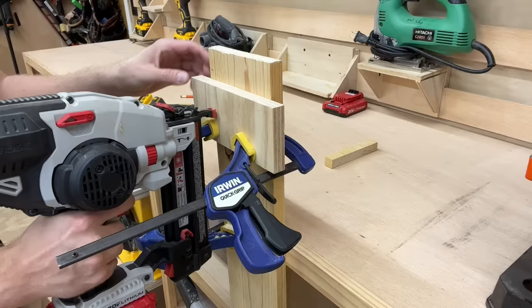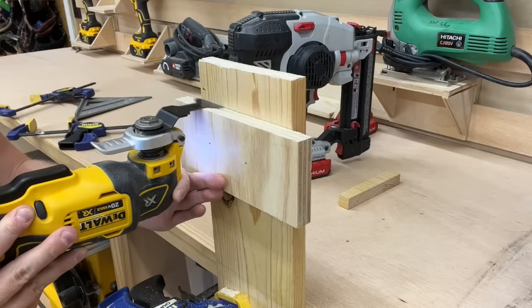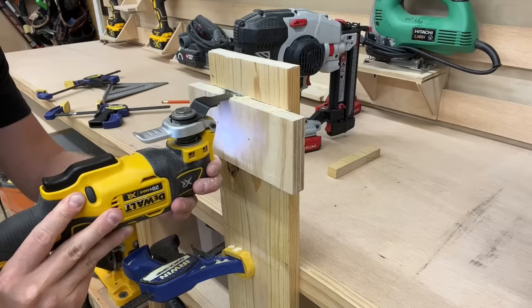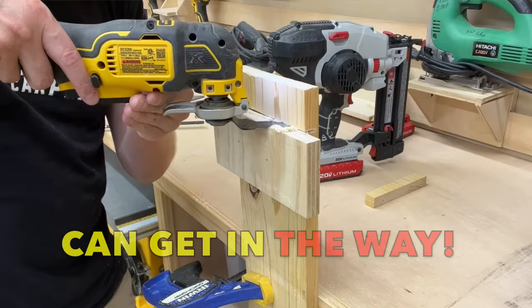Some people like to use a guide block to start their cut. To do this, make a square cut on a piece of wood — preferably with a miter saw — then clamp or nail that piece just a shade below your cut line. This block provides a straight backer guide for your blade as you initiate your cut, keeping your blade vertical and ensuring you travel in a very straight line. I don't do this much in the field because my hands have gotten pretty steady with practice, but these blocks can be very helpful to newcomers. Just remove them after your first few initial passes, as they can get in the way as you drive deeper.